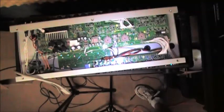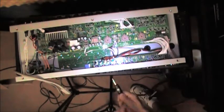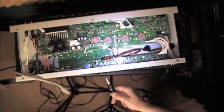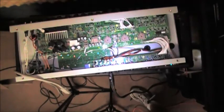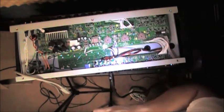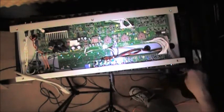Okay. So I have flipped the unit back over. I'm going to go ahead and reapply my 8 ohm load. It's already plugged into my speaker cabinet in the correct port. Please double check, guys. Don't plug an 8 ohm load of output into a 4 ohm load or vice versa. Fundamental 101. If you're going after a particular sound or want to blow something up, I'm all for it. I just assume for this video, 8 ohm load, cabinet, 8 ohm connector. So I've got my speaker cable plugged in.